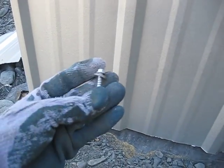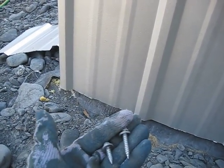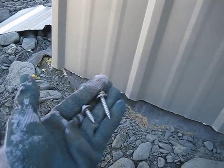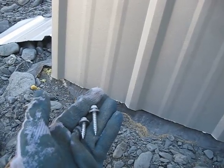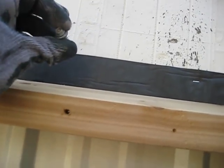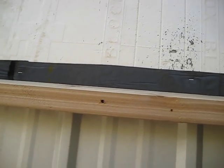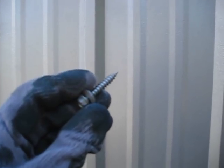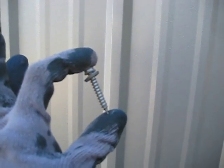Speaking of screws, I wanted to talk a little bit about what was going on the other side of the building. We originally just had these shorter screws, and the building supply store said this is the only size we have, which works fine if you're just screwing into OSB or some wood, but with the ties here on the ICF, they had to go longer, so those shorter ones were just catching. I'm like, this is not working, please go back to the store. So Scott went back, and lo and behold, the guys said a bunch of people were asking for those longer ones, so they got them in. Oh, thank you so much. So this is working. The saga continues.